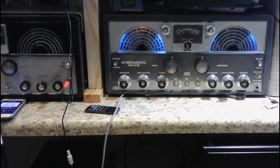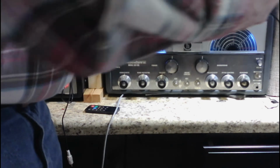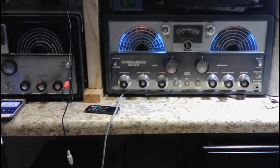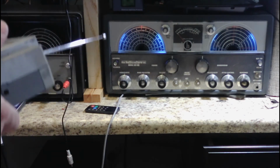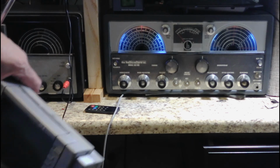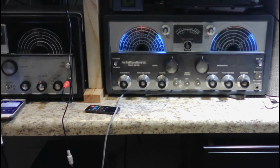And I have a little detector here, an Eton E1. Sounds really rough. This is at 3300 kilohertz, which, from experience, I know is one of the worst areas in the high frequency band. As you can see, there's just every kind of noise source: switching power supplies, DC power supplies, and ground loops, double ground loops, triple ground loops, and everything else in here.